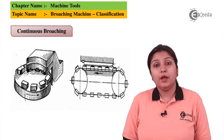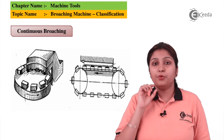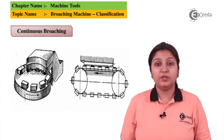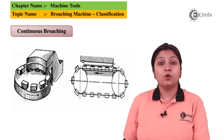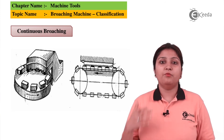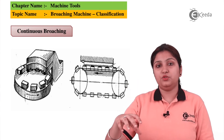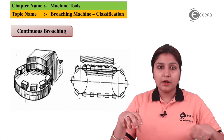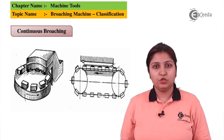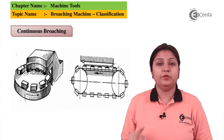In this diagram you can see a different kind of broaching operation, that is continuous broaching operation. There is a broach tool at one end and the object to be broached — the object to be finished — is rotating continuously. The upper part of that object, which is in the form of a block in the current picture, can be easily finished by just rotating while the tool is stationary. The object is rotating and the upper part is getting finished continuously. The objects to be broached are kept in position and the tool has some teeth which help in broaching.